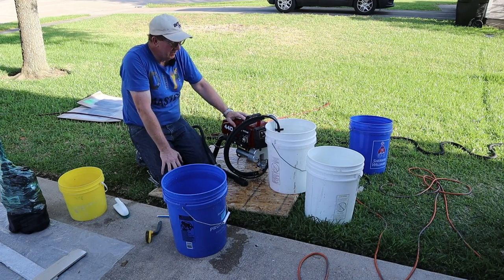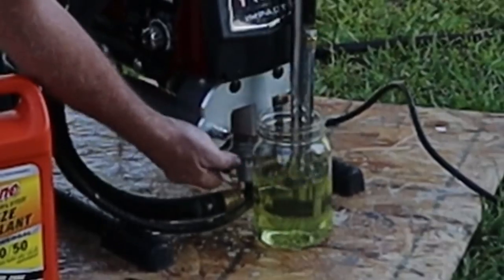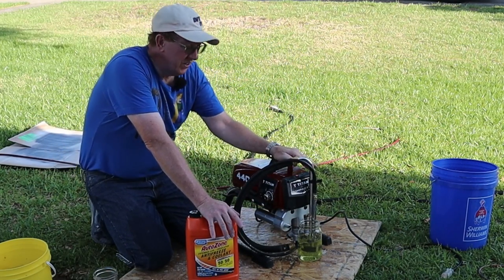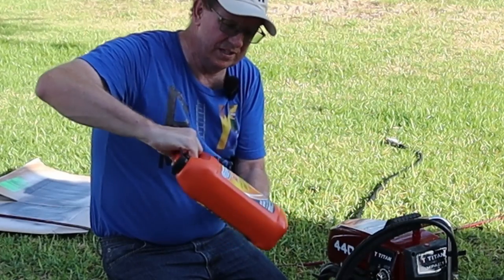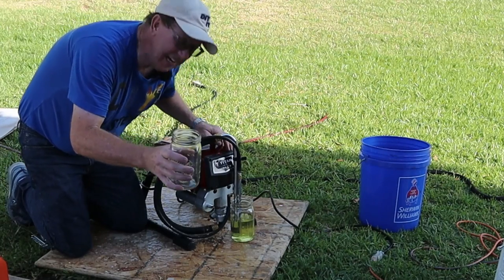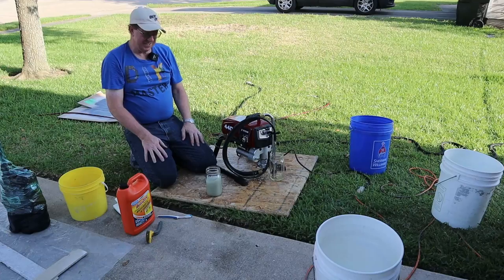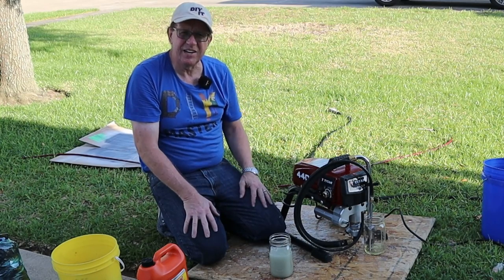Last thing I need to do if I'm not going to use this for a while is winterize it. You don't want to leave water sitting in here. This little red valve down here has a little ball that can get corroded, and this valve is to push and unstick it. If it's going to sit for a while, you need to winterize it. All you need is half-and-half antifreeze from your parts store — that's what this is. I'll put some in here and pump some through. I'm going to collect it because antifreeze is dangerous to animals — I have cats that come around and I don't want any of them to get sick. Put it on prime, turn it on, and it's winterized. Next time you use it, just run some water through, clean that out, and you're good to go.